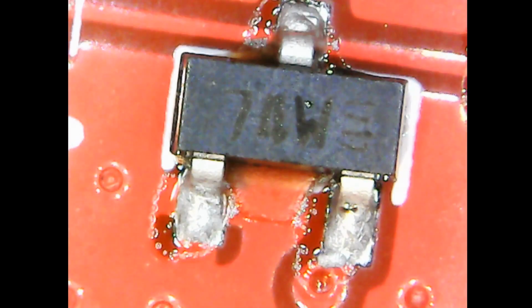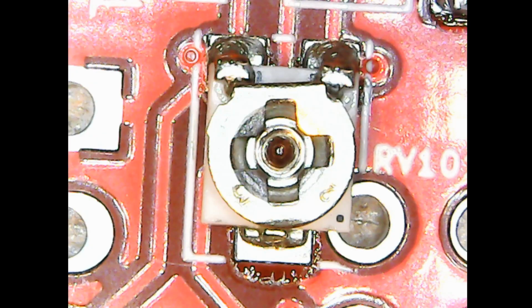The SD card holder looks good. The solder took to all the pins of the double Schottkys, so they look fine to me. The big diodes look fine. The LEDs, more diodes. More LEDs, resistors, the trim pot. I visually checked every soldered joint and they all look like they've all taken, so it looks like the soldering has worked fine.